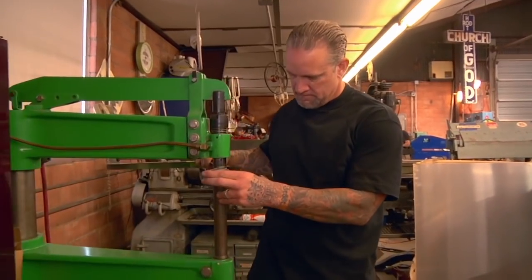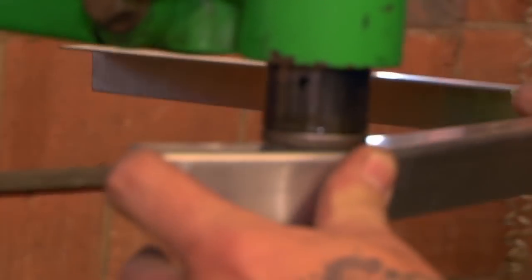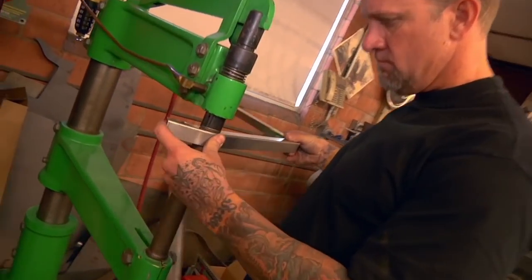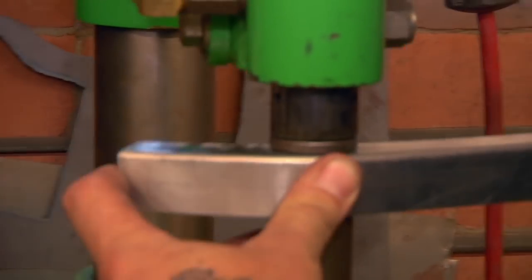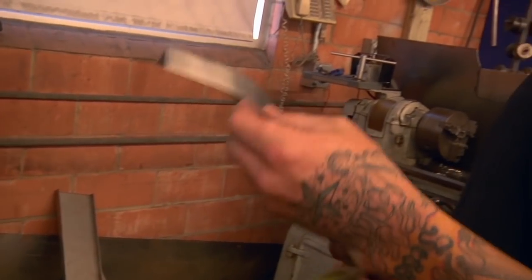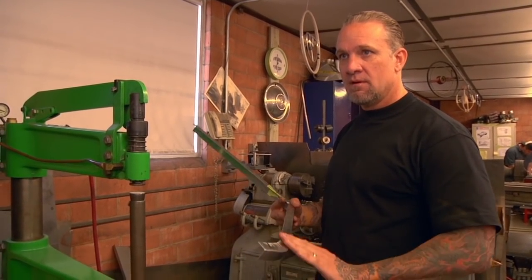The first couple days is just getting a plan together, visualizing what we want to make from a small picture pulled off the internet, then measuring and figuring out the size and the profile, and then just start cutting metal and trying to stick it together and see what happens — trying to hammer and get those shrink marks out so it's a little smooth, so we can sand it and not have that big edge on it.